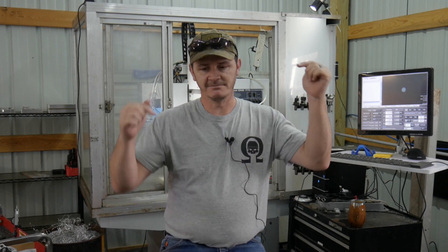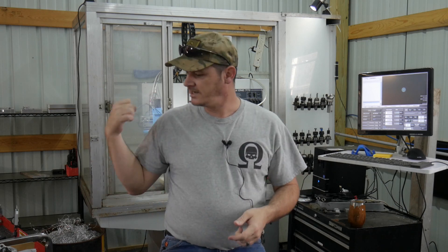Hey guys, sorry it's been so long since I posted a video — that's going to be changing. As promised, I'm going to give you the rundown of what you need to upgrade a Tormach Series 3 — or M, whatever you have, 770 or 1100 — with hybrid stepper motors. I have links down below to where you can find the steppers. You're going to need 20–30 feet of four-core wire for the steppers going to the drives. The encoders come with plenty of wire, so you're set there. If you choose to jump it out to the limit switches so that it can fault out, that's a nice feature, but not necessary to run.